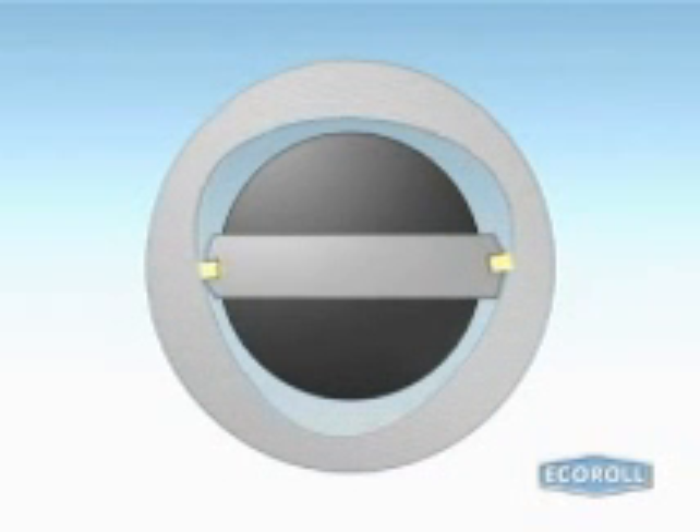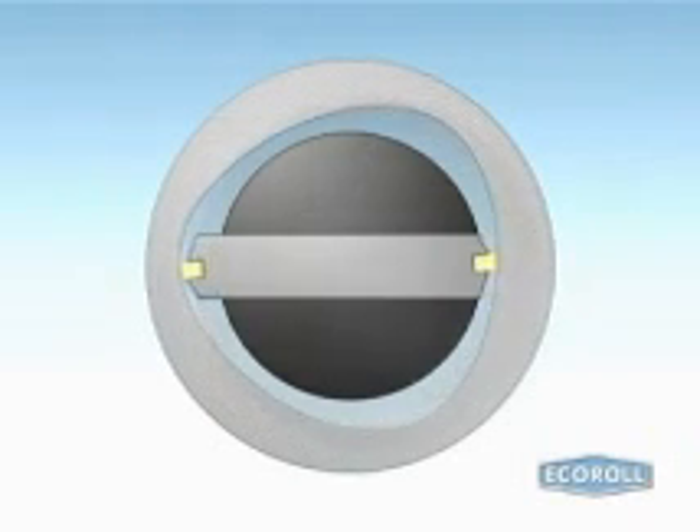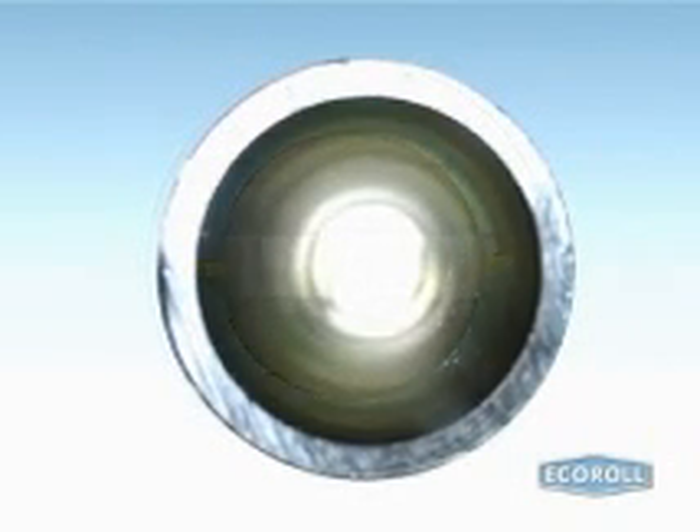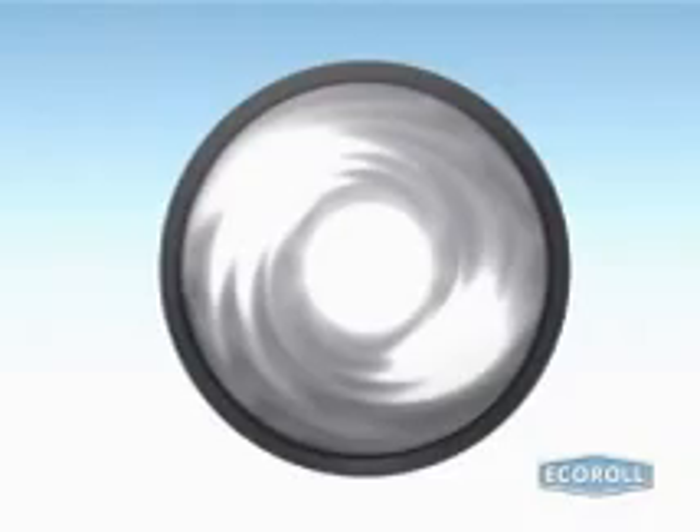In contrast, conventional knives oscillate, cutting chips of equal thickness and thus preserving the existing circular form deviations in a polygon-shaped bore, for example. In a finished cylinder, such form deviations show up as ripples. Such cylinders cannot be used for hydraulic applications.